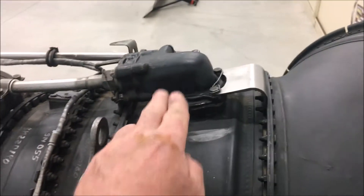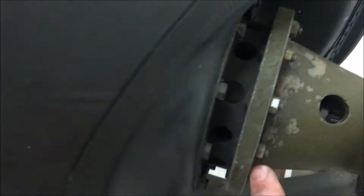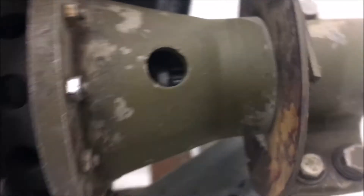There's electrical speed feedback for the power turbine, and this is the accessory gearbox for the power turbine. There's a flexi shaft that rotates in here for N2 feedback. It has a lovely spline output shaft — there's a flange to support the engine, and a spline output shaft in there. The RPM of that shaft is approximately 15,000, and it's about two inches, or 50 millimeters, in diameter.